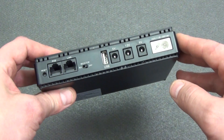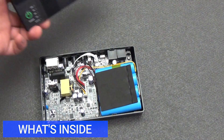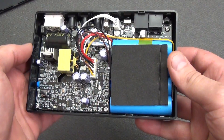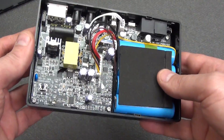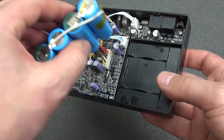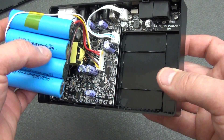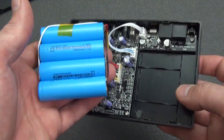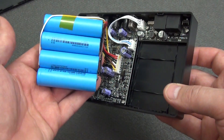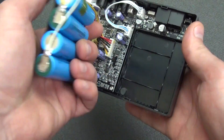Let's see what's inside this uninterruptible power supply. To do this, simply unclip the top cover. The main space is occupied by a fairly large control board. Everything is done quite well — I don't see any traces of bad soldering or unwashed flux. The battery assembly consists of four 18650 Li-ion cells with a capacity of 2,550 mAh each. Judging by their weight, I can confirm their capacity — they are quite heavy elements, so the capacity most likely corresponds to the declared one. If necessary, you can replace these elements with more capacious ones.